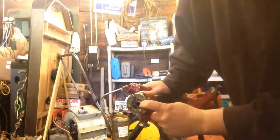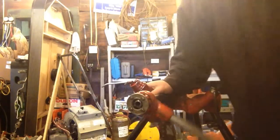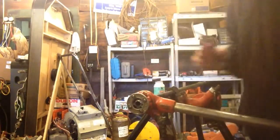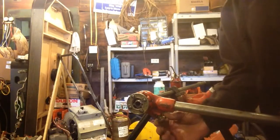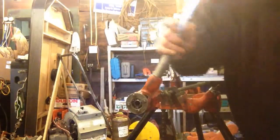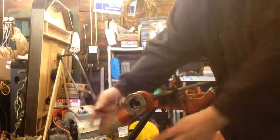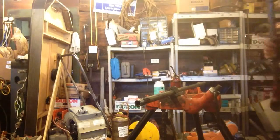My threader's gone in past the end of the pipe, which I'm okay with there. That'll make nice threads. We'll go ahead and remove — we need to flip this rod so we ratchet the other way. There we have a nice clean thread.